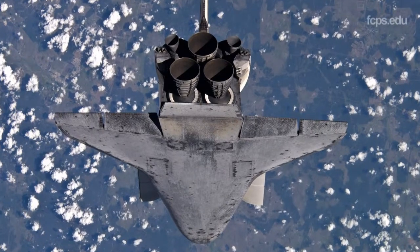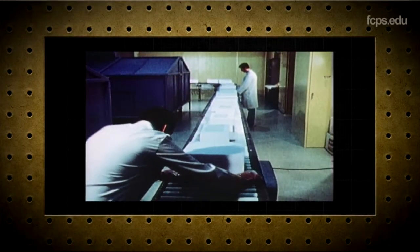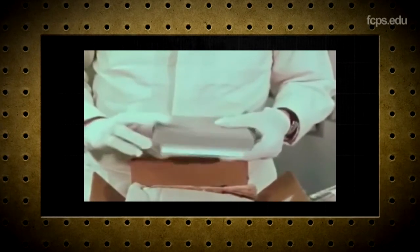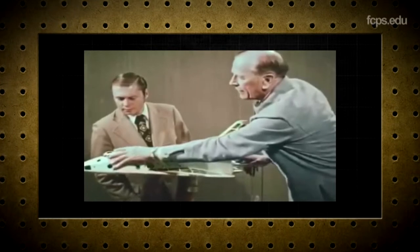Each shuttle orbiter has more than 22,000 tiles. Like a giant puzzle, each is unique and was customized for each specific location. Special milling machines did the precision work of carving the tiles, and identification numbers were printed directly on each tile to show the location. The question of how to attach the tiles to the shuttle orbiter became another big challenge. For several years at the end of the 1970s, when they were ready to apply the tiles to the first space shuttle Columbia, they had a lot of difficulty getting them to stick. It turned out they needed not only to be doing research into the tiles themselves, but into adhesives and how to apply a rigid thing like a tile to a slightly flexible thing like the airframe of the shuttle, because it was going to flex a little bit during the aerodynamics of flight.